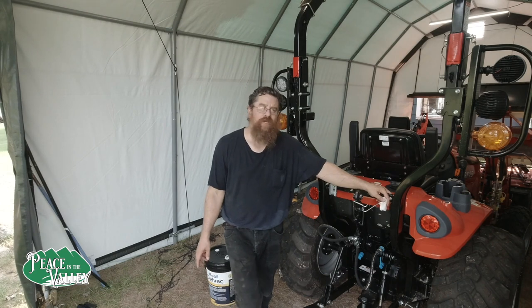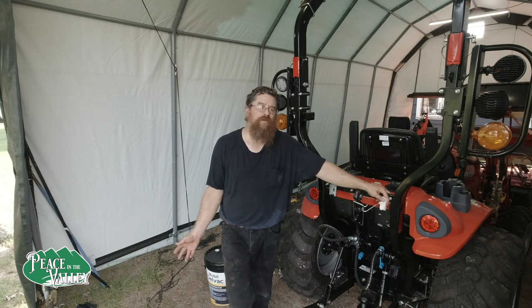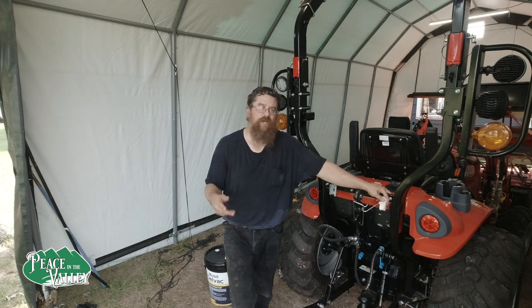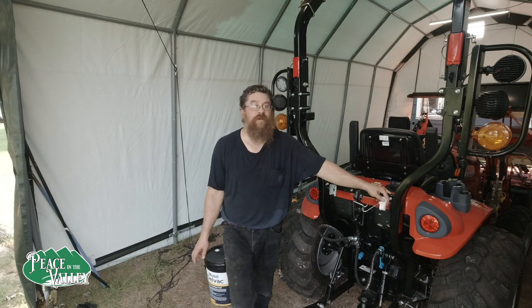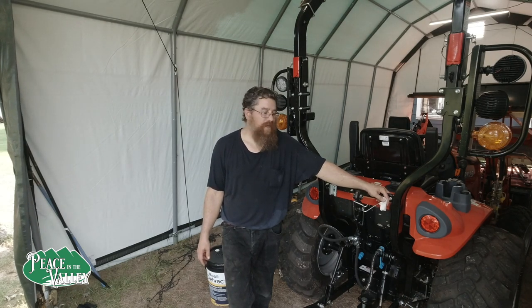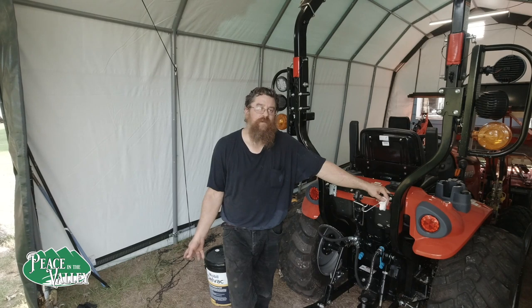Also, make sure that you know when you're in high and low. When you're loading on a trailer, put it in low, put it in four-wheel drive. Make sure the rear of your trailer and front are supported, okay? Do not take chances like I did. You can watch my previous videos. I could have easily damaged the trailer or the van. And make sure everything is well supported. You've got everything hitched up, you've got jacks under the back end. Anything that will keep your stuff from being damaged, do that.